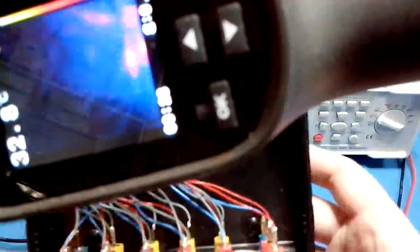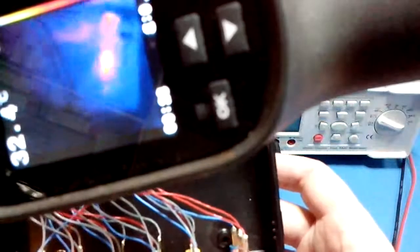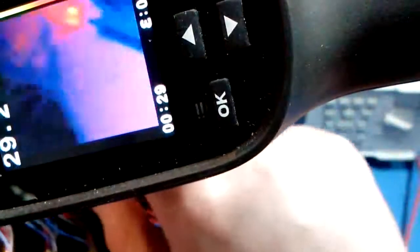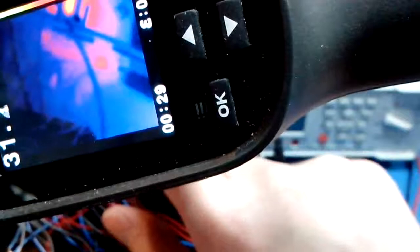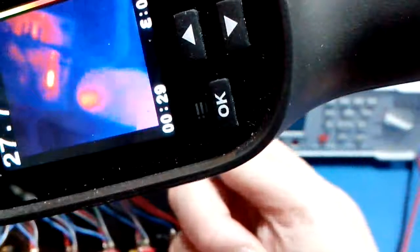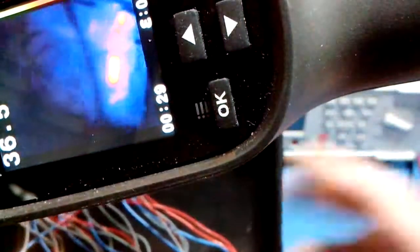I highly recommend getting an infrared camera, or a FLIR one for your phone, because it's a really brilliant debugging tool. It saved me a lot of time already. Now as you can see, the thing that's getting hot is the resistor there. I can touch it with my finger, no problem. I'm touching it right now, and it's been on for just a little bit, but I can maybe feel it getting warm. It's not a big deal. Looks dramatic, but it really isn't. So this is fine, right?